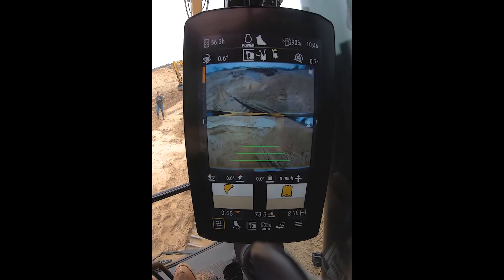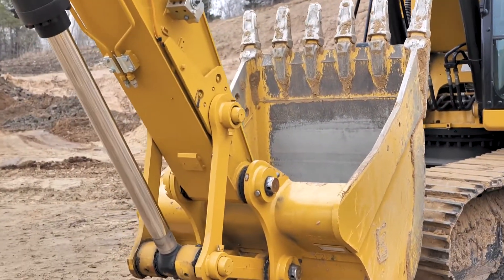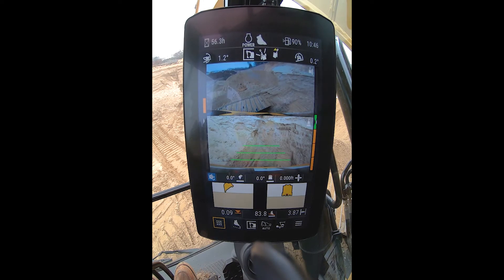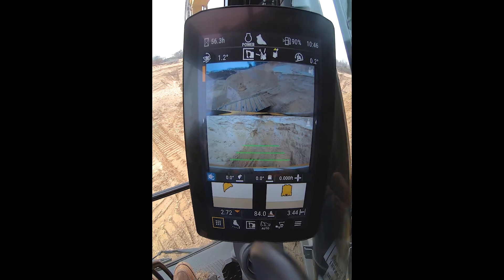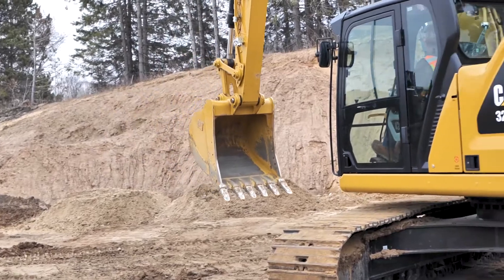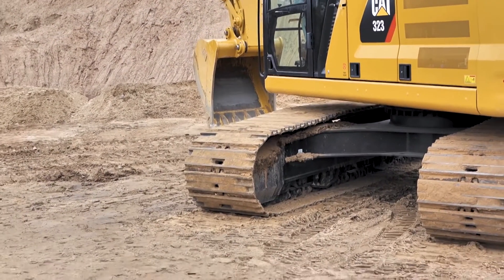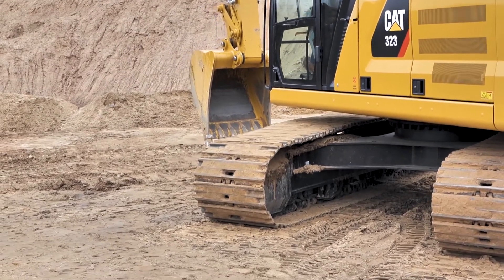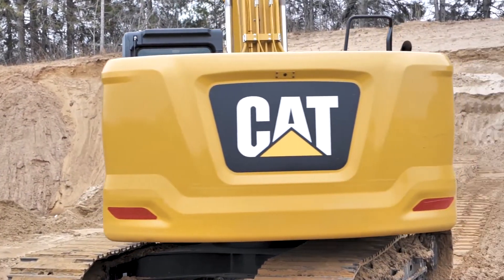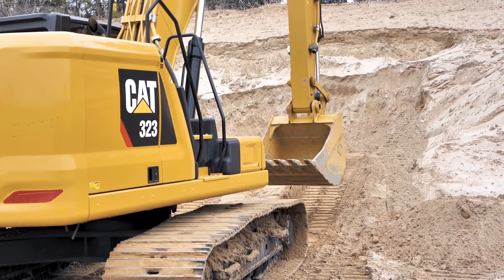So let's go ahead and try to correct that. We're going to get the laser beam down in the lens again. Get that green, hit the button. Laser has been accepted, so our correction should have been made. Now we come back over here and touch our point — and bam, we've got our correction. So that's how we're going to use our laser. We're not digging with that laser in the glass. We're just using it as a reference point before and after we move the machine.